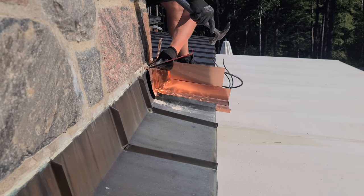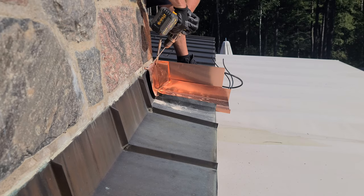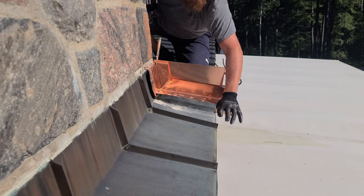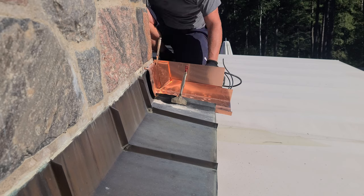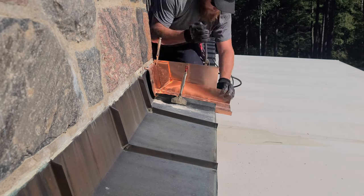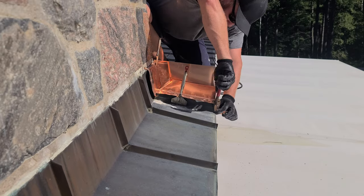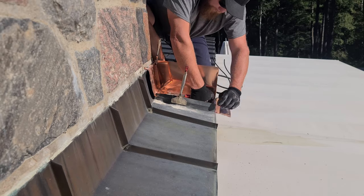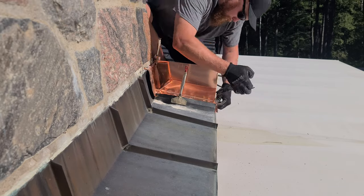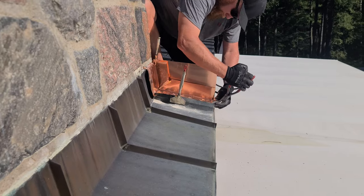Here I pre-made these little front connection pieces to wrap around the face of the chimney to the existing front panels. Again I use the same pocket form detail, and pretty much the same approach on this sweep seam. It becomes pretty second nature, I will say, over my very short time performing these details and getting really into double fold. What I have noticed is your interpretation of seams and your 3D thinking expands to include bisect folds and how your creases go. Over time it just becomes second nature. Give this stuff some time — practice it. It gets a lot easier with practice, like anything.